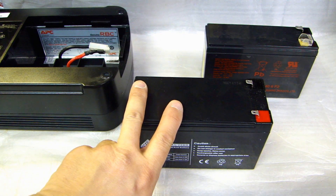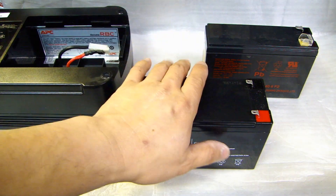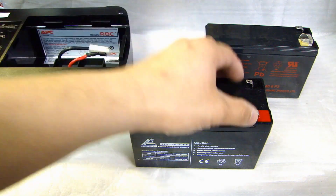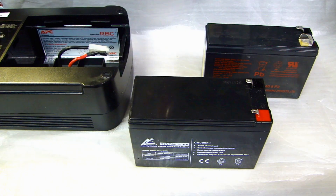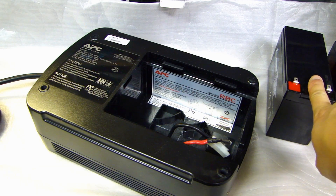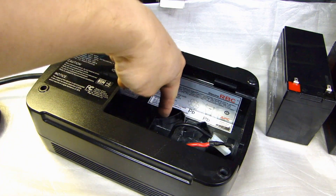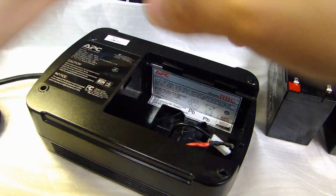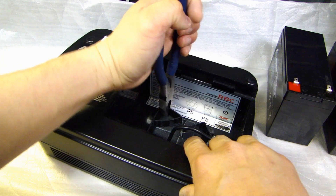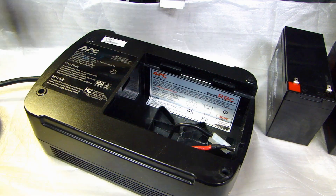However, if you have a narrow connector on the plug — say F1 — and you bought a battery that's F2, then the plug will not be able to connect from the small to the bigger terminal, so keep that in mind. With the old battery, make sure you recycle it — don't just toss it in the garbage. Because this new battery is a little wider, to fit into this model of UPS they have a little plastic ring molded into the bottom as a spacer. I'm going to get a plier and remove that so the space opens up and the battery will fit.